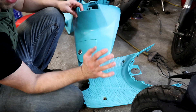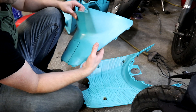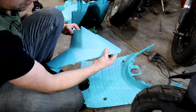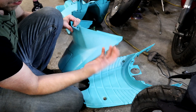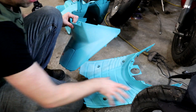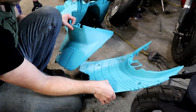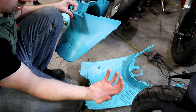Just keep it cool. If the plastic is hot, don't set it down with the piece distorted because it'll stay that way when it cools. You shouldn't be getting it that hot in the first place, but it's something to take into consideration — if you heat up a whole side and then set it down at a weird angle while it's bent, when it cools it's probably going to want to stay like that.